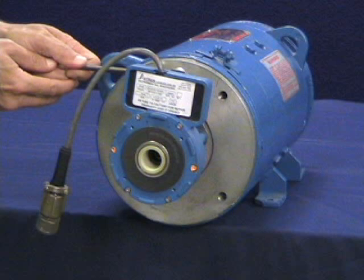Power up the XP45. Begin to turn the shaft. The XP45 electronics will self-adjust for optimal signals. The remote diagnostic contact will be inactive. If the remote alarm contact is active, check the manual for troubleshooting procedures.